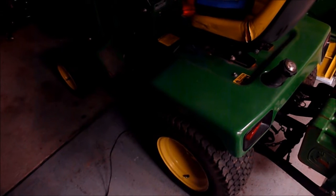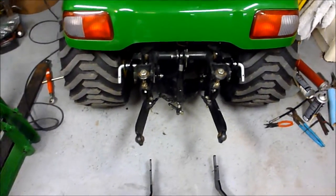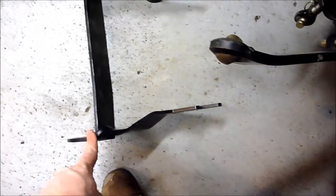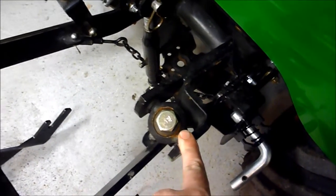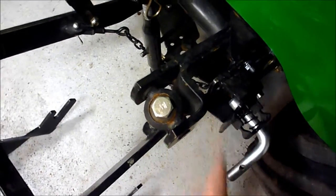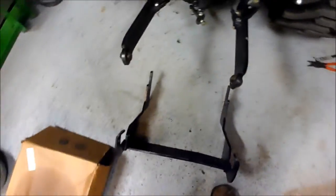What I failed to mention earlier is I don't have the quick hitch for the 318 yet, or I would go ahead and show you that full setup. Hopefully it'll get here later this week or early next week. Okay, got the X748 backed in here. Just to show you again what the problem with the category zero hitch is — here are the brackets for the click-and-go. This tab on the click-and-go slides up in this area right here and clicks on that pin. Clearly, with the category zero three-point, this whole assembly is blocking that pin.